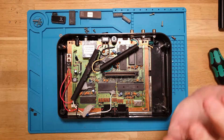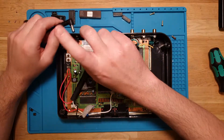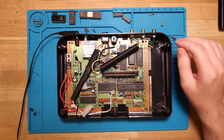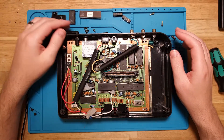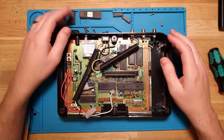I've got my bench supply ready for 9 volts. I also have this set to center negative because I know this is center negative, so let's plug that in, switch it on, and the power switch here. And we are drawing absolutely nothing - no current whatsoever.